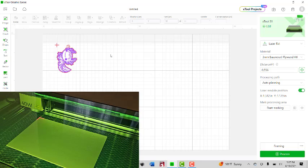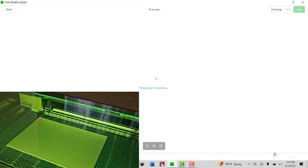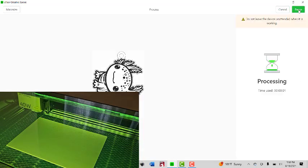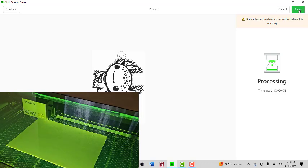I'm going to turn on the air assist. I did not hear it come on last time — maybe because it was just engraving and it would have come on when it cut. There's an auto setting: off, one, two, three, and max. I have it on setting three right now and I'll adjust it while it goes. Hit Process, wait a second, hit the button, click Start, now hit the button — and there it is starting to engrave. This time it's working. It's not clear acrylic like last time. I realized when I looked at it closely, all that was happening with the acrylic was the masking was bubbling up.